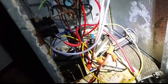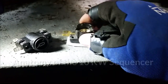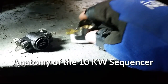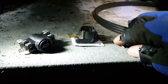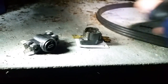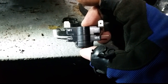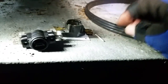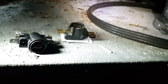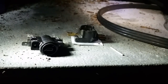Here's the old sequencer - you can see the different parts. There's the bottom section where the control voltage goes, and you can see the bi-metal disc inside. What happens is that disc will flex and push up on one of these rods - they go in these holes - and when they push up, they make a circuit. That's how sequencers work. There are two rods, though I lost one, but you get the idea. It kind of fell apart when I was taking it apart, so I figured I'd show you what's inside. They're pretty simple.